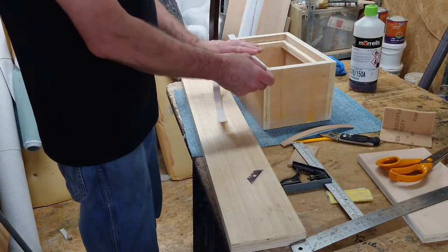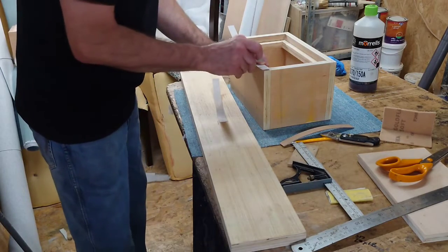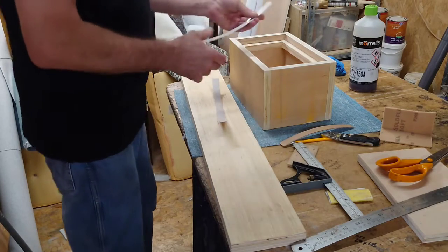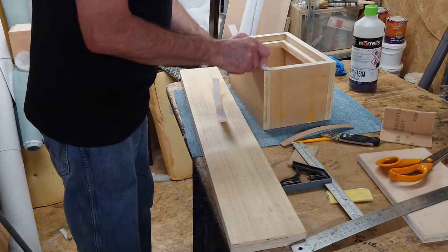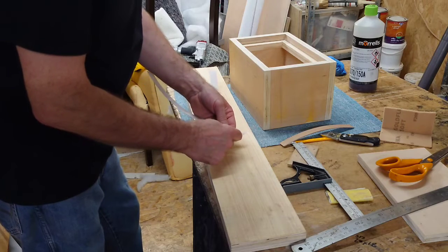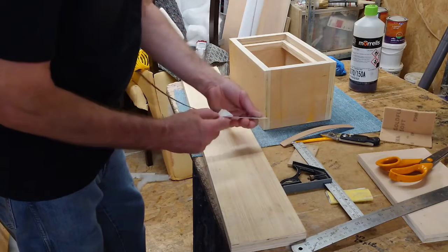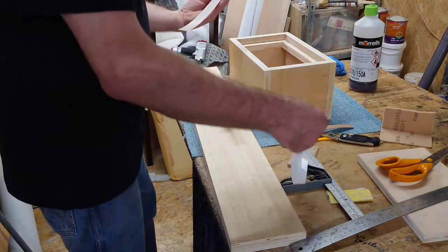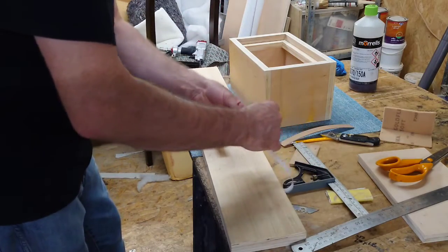So what we want to do is offer the veneer up to here. And because this has got a peelable back, we want to just score the peelable back there and here, like so. And then we want to just take up the middle section of it, like so there. There we go. Peel that back nicely. Right, the whole thing's come off of that now on that end, so I want to stick that back onto there.